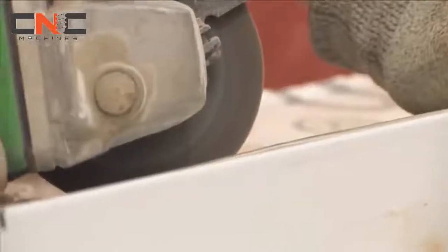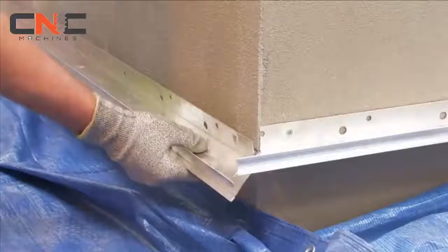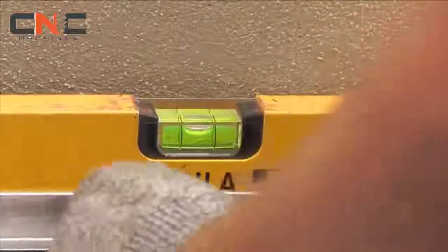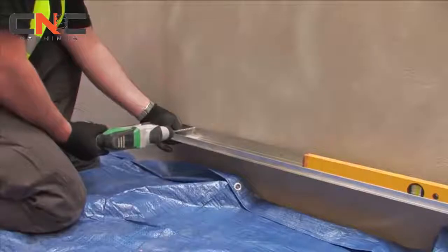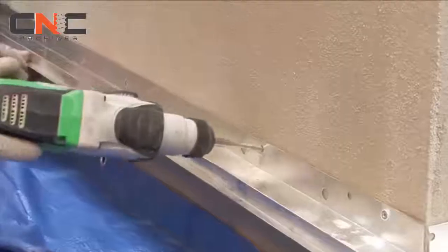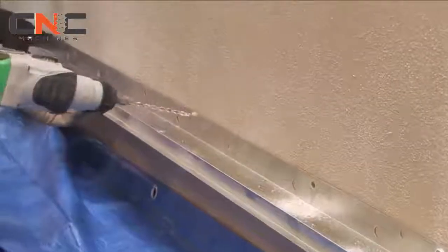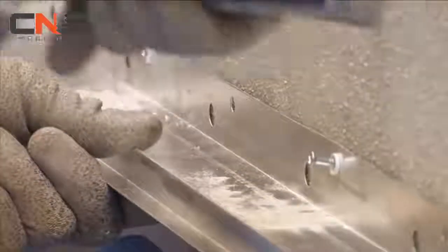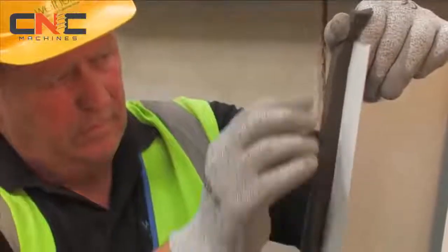Any full-depth surface profiles should be firmly attached and a suitable base rail installed at approximately 150 mm above ground level. Take care not to bridge the damp-proof course. The base rail profile type is determined by the insulation thickness and should be installed at a maximum of 300 mm centres and 50 mm from each end, using approved Weatherby fixings.